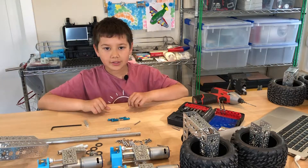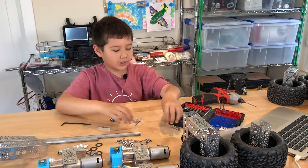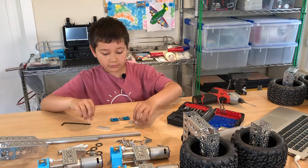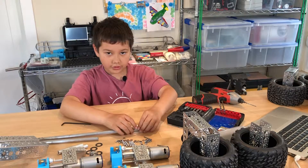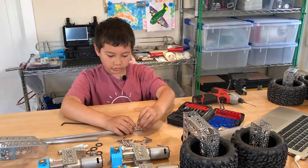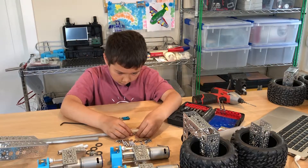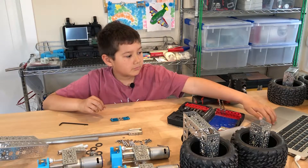I finished drilling the aluminum rod. Now it says to test the holes by taking the five-hole aluminum beams S21 and screws B7, making sure that the screws go all the way through as shown in figure three. If they do not fit, you can file or drill the hole out until they pass through. It wants us to take two of these five-hole aluminum beams and place one on each side, then take a B7 screw and place it all the way through the hole.